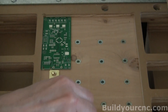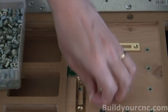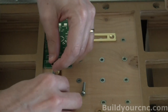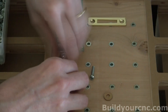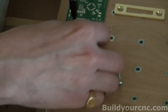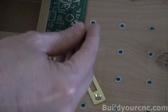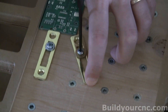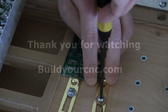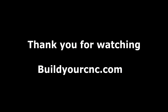Now we can use this for clamping. We can take our clamps — yours will probably be in plexiglass — and take a number 8 screw, three quarters of an inch, with a washer, and just screw it in to the nut. Make sure that your PCB is pretty tight against the corner here. The plexiglass will be a little longer, so it will be more versatile.